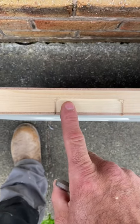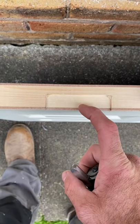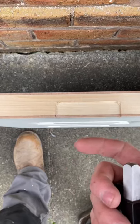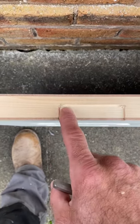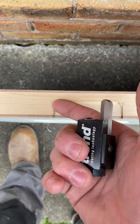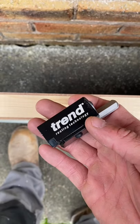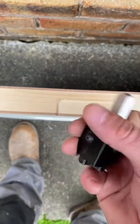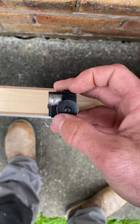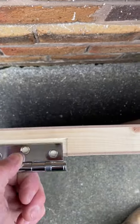The router is done — you can see it leaves a nice smooth finish. You can do this with a chisel in the more traditional way, but once you've got the experience and need the speed, a palm router is definitely the way to go. You'll notice these little nips in the corner — you can tidy those up with a knife or a chisel, but we've got one of these Trend routing technology corner chisels. You sit that into the corner, give the metal peg a little tap, and that'll tidy that edge up.